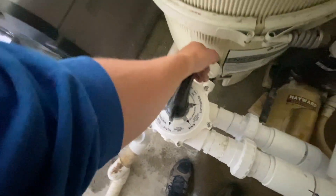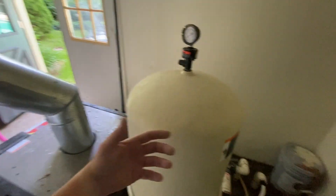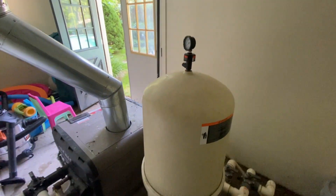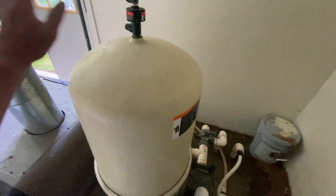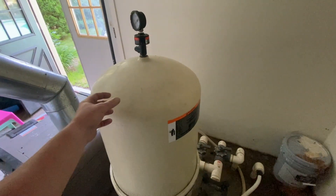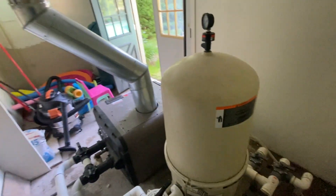The last time I do a little bit longer rinse, put it to filter, and sometimes I'll even run the filter for 30 seconds and do one more backwash. I find that just agitates the filter and cleans it better. I've done this for 17 years — that's my way. A lot of websites and help forums tell you just let it run for three minutes, but the loose stuff comes off and then the stuck stuff just stays and you're wasting water. By agitating it — doing backwash, rinse, and repeating — it helps mix everything up and you get a much better backwash.